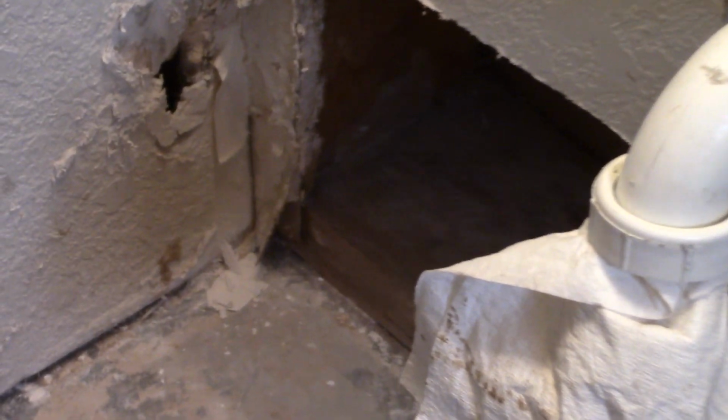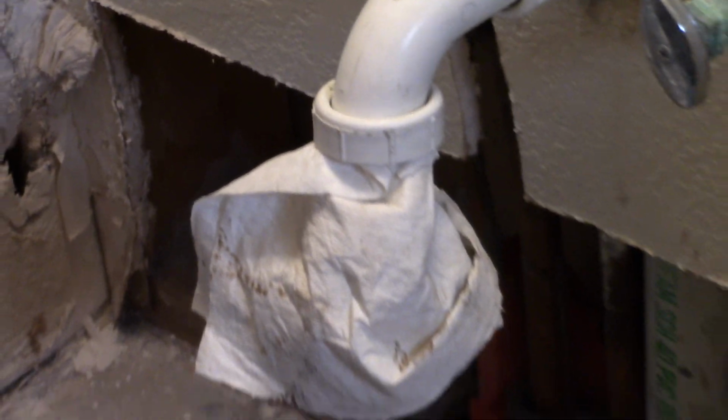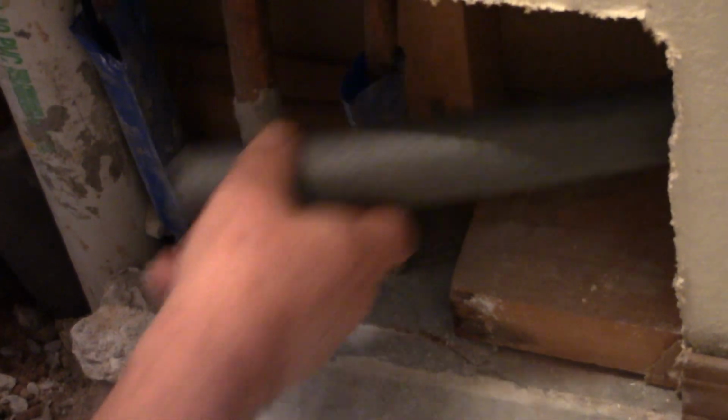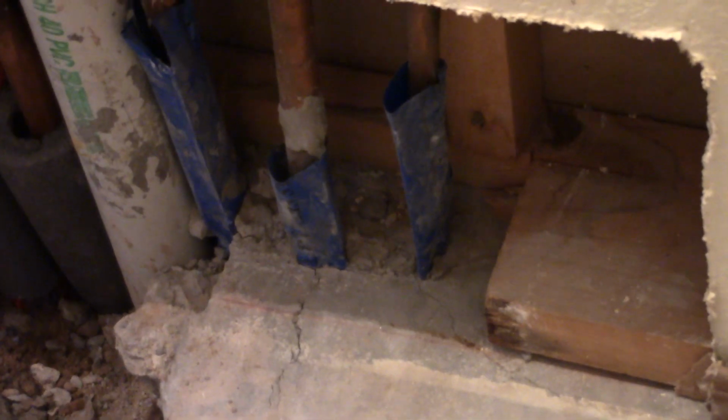I see there's a sole plate over here. Do you put anything in there? Well, because they cut that, there's nothing vertical running through here. There are no studs. What are you going to do with that? So what I'm going to do is use that piece of wood we have, which is 1/2 by 2 inches, and place it behind this drywall right here. It's going to be a shorter piece, and I'm going to be screwing my drywall into it because it's going to be hanging over.